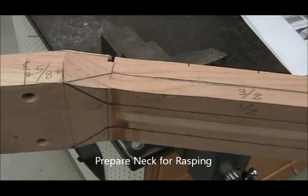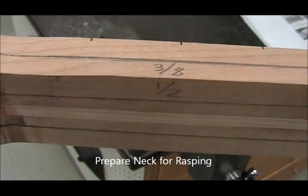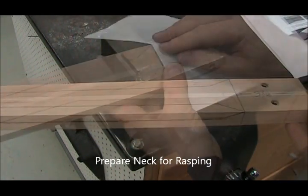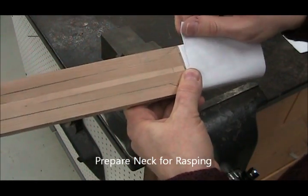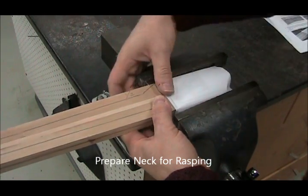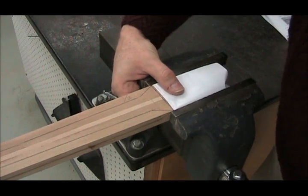You can see we transition at each end. We don't want to go more than five-eighths closer to that tuner hole. With those lines in place, wrap it with paper around the blunt end — this will protect the sides from the vise jaws — and install on the vise. Put that three and three-eighths line slightly set into the vise jaws to protect it further.